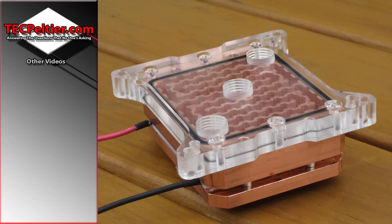This has my three barb system — cold in the middle and hot out the corners. I could have gone for a two barb system by deleting the centre one, but that would mean one side of the TEC block would be receiving the coolest freshest water while the other end would have the hottest water, resulting in a temperature gradient across the block. Having a temperature gradient across the TEC is a particularly bad thing — you need to cool it equally well, otherwise you may only be getting 80% of the cooling potential. So cold in the middle, hot out the sides — it's equally cooled.